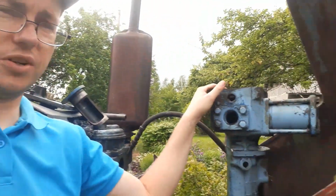But I'm going to keep this one for its sake, because all the newer tractors after the year 2000, all the Belarus tractors, came with a different power steering set. They got rid of this front bolster entirely, and the power steering is by an external hydraulic cylinder. For that, they also have mounting brackets and mounting bolts on the front axle. This one doesn't have those, it's the older style. So I'm keeping this part, but I'm leaning towards changing out the entire front bolster, because if I throw this together with these really worn and not great parts, I may just screw myself in the end.